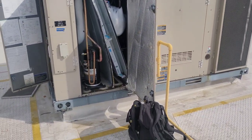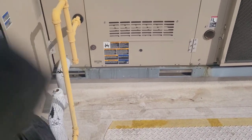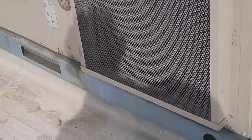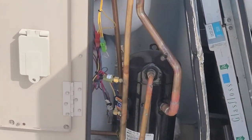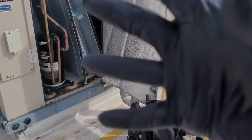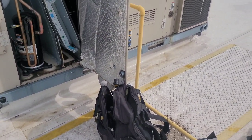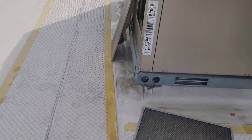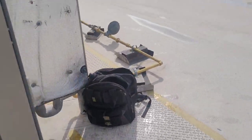So a key point to take away from this: the reason we didn't see it dripping water — and you can see it's dripping water now — is that most of the time when the drains plug you can see it dripping water. But in this case it wasn't, because the negative static pressure in here was so strong that on all the seams it was sucking in so hard that it wouldn't allow any of the water to go out. As soon as I opened this door, it all gushed out, and now that the door's open you can see the water is dripping on the corners and everywhere it can.